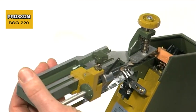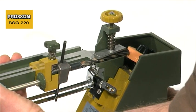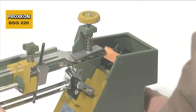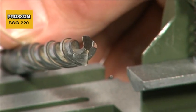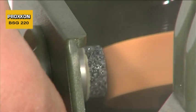Fine configuration of the grinding depth can be achieved via spindle with rapid axial adjustment. This also ensures the achievement of the essential symmetry on both cutting edges. With a little practice, your drills are as good as new again.